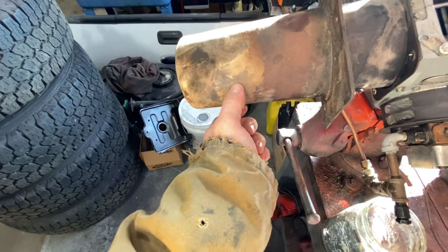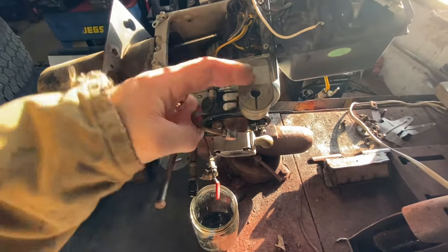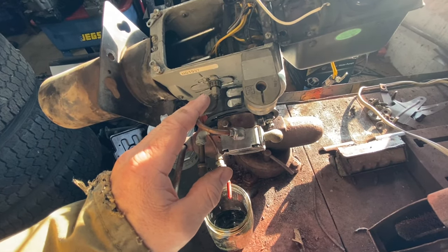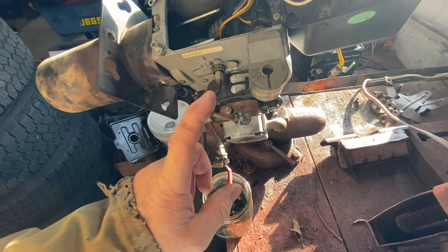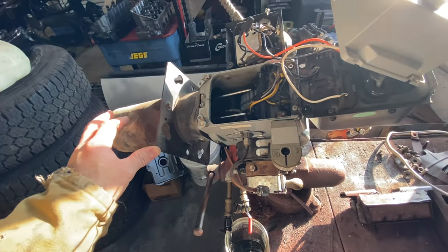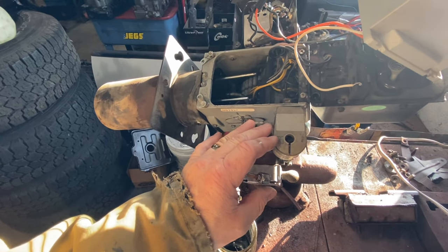The heated block receives everything and injects it out. A couple other things to note: this is an air solenoid which we are not using right now - it's just there to keep the hole blocked. I would recommend this air solenoid if you're going to run a thermostatically controlled unit - in other words, if you want this to turn on and off at the demand of your building. This will shut down any air when it's off and restore air when it's on. Also if there's a fail-safe issue - flame goes out, whatever occurs - it shuts the air down. Mine is more manual because I'm here all the time and only fire this in its presence, so I have it bypassed.